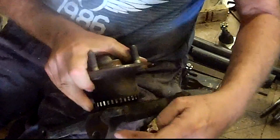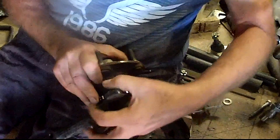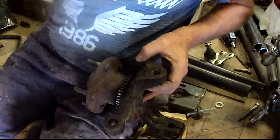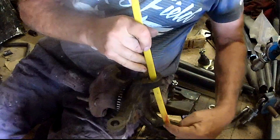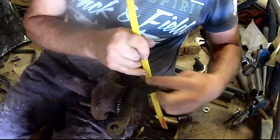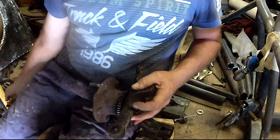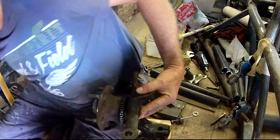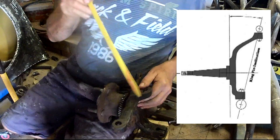I referred back to my suspension book to see what they were talking about. You'll notice that those pivoting points are not the same distance from the hub - it's not in a parallel line. In fact it's quite marked, and even though this hub hasn't got kingpins, this angle here is what's called kingpin inclination. The hub is made so that one pivoting point is different to the other. Using these upside down has made the kingpin inclination the wrong way around.